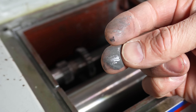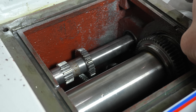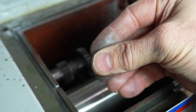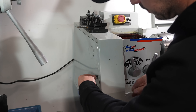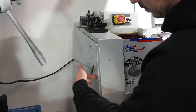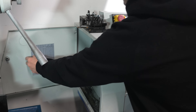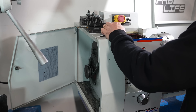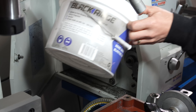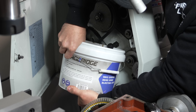More metal paste has been found, but its location is still consistent with spindle bearing grease being thrown around and hitting the sides in this area. It's now time to open up the rear cover to expose the location of the oil drain port.